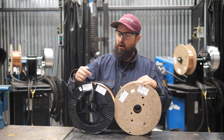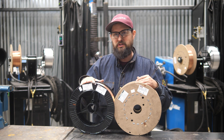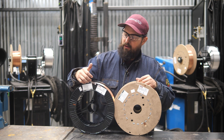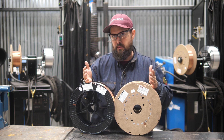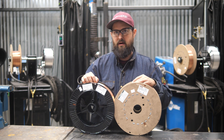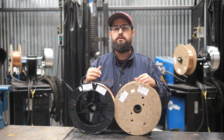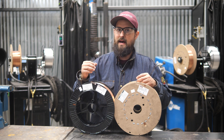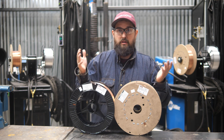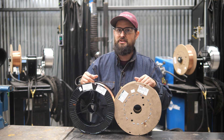Well, it's a proprietary coating on the wire. I found this out from Lincoln when I started asking what is so special about this wire and why does it run so different. Now, is that in the copper coating on the outside, or is it in some sort of lubrication system of the wire? I'm not sure — it's a proprietary solution for the L59, but it makes it run absolutely fantastic. The other thing it does is increase its deoxidizing as it welds, so it's able to scavenge the impurities off the weld and clean better than you'd see with an L56 or a similar ER70S-6 product.